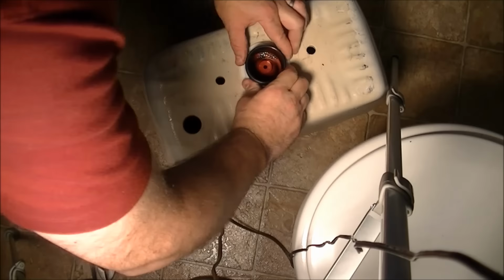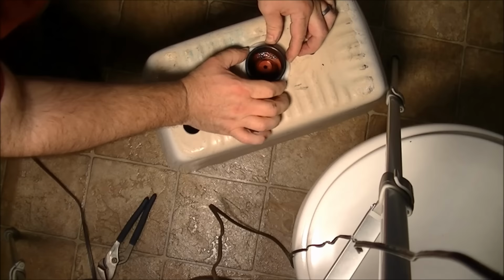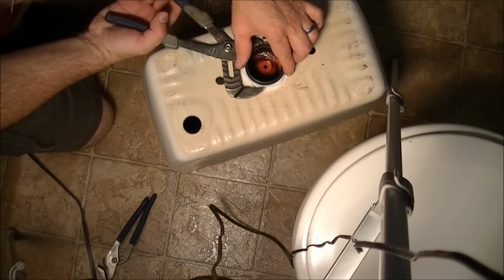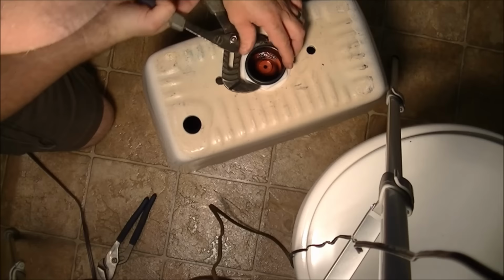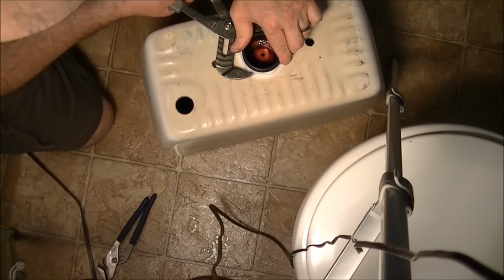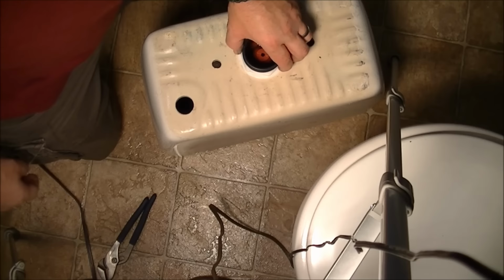Now there's a rubber seal on the other side that keeps it from moving anyway. And you can see that this is not moving here with the flapper. Okay, and next, I'll use my channel locks. This one is a little smaller nut, or the easier nut to turn. Like I said, it's plastic. Don't go crazy on it. Snug is good. That's plenty right there. Don't need to go any harder than that. I can't move it with my hand. It's on there really nice and tight. Yeah, no more than that. So about a half turn past tight with your hand. If you go too far, you split it or something will break. Or you'll end up cross-threading it like the last guy did. Either way, that's tight enough.